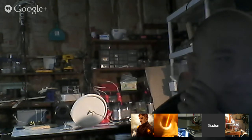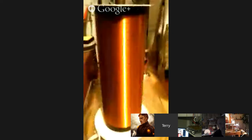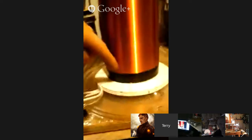It's interesting. It's almost like a feedback from the ground itself. So this coil, it's not connected to the circuit. It's the Slayer exciter. It's not even earth ground. I've got a 2N3055. And basically, this is the pickup coil, and this is a trifilar. So it goes in at the top, comes out, goes back in, comes out, back in again and comes out, and then goes out to the flyback primary.